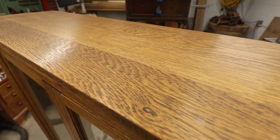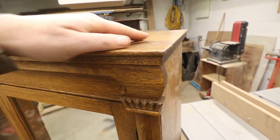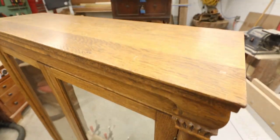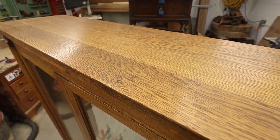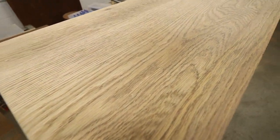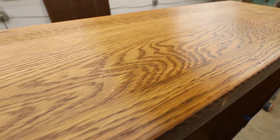I'm going to try to figure out the top. I Windexed it down with some 4-aught steel wool - doesn't look terrible, but there's a big dark scratch and a lot of the finish seems to be missing on a lot of it. So I'm just gonna have to mask this off from here down and refinish the top edge and the top, just because the rest of it all looks good but the top has too many scratches and is missing too much finish. Now the top is all sanded down to 220, got those scratches out and any little dings - it's not perfect but it's much better than it was. There's one pass with the gel stain and that color is pretty close already.